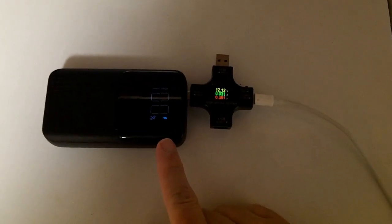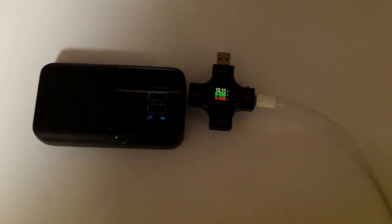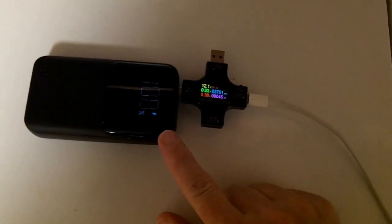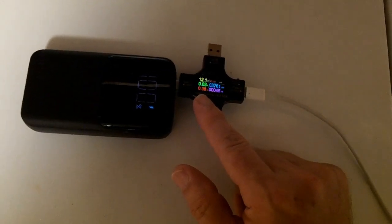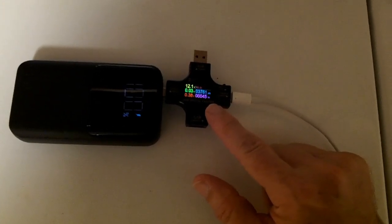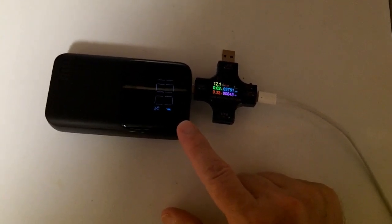This is charged up to 100% overnight. Idle current looks like it draws a third to almost half a watt just sitting here maintaining charge. It has taken in 45 watt-hours to charge it back up. Some of that is probably the idle current — a third of a watt over a couple of hours could be 2 or 3 watts — so we'll say about 42 watt-hours to charge it back up, which seems reasonable given the 37-watt-hour battery specification.